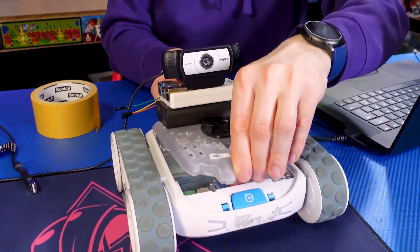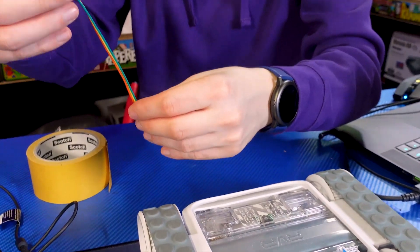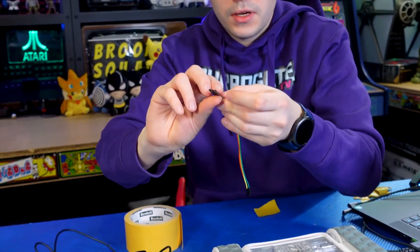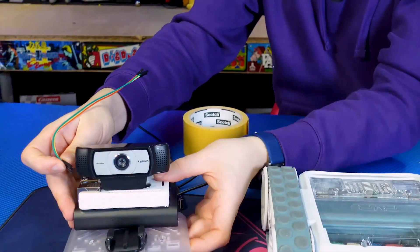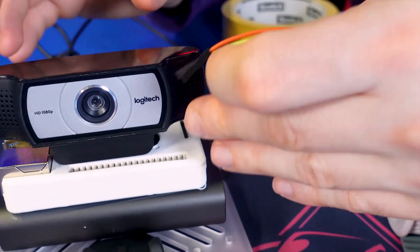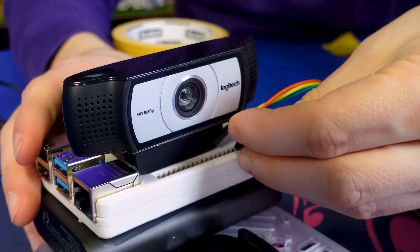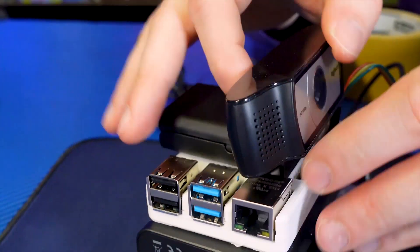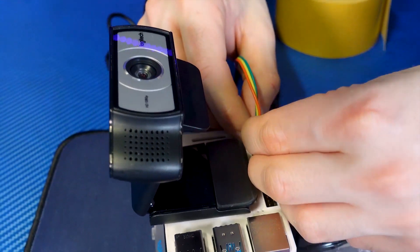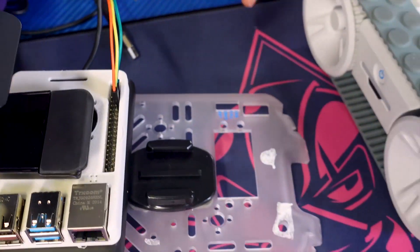First thing I'm going to do is remove the top plate and now I'm just going to connect the cable. The way you do it is make all of them in parallel on both sides, the same way. The ground cable is going to be green in this case, and we connect it to the ground of the Raspberry Pi, which is the third pin on the front side. Then I'm connecting the RXO and TXO — make sure they're all in parallel. So one, two and three: ground, RXO, and TXO are connected here, and now we've got to connect them on the other side.